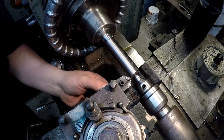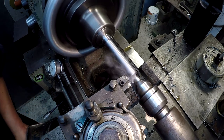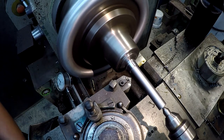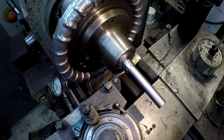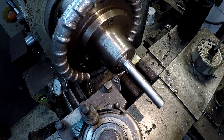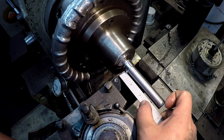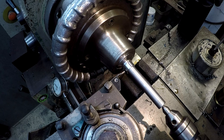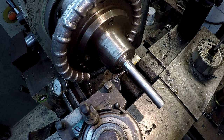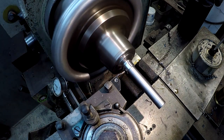We're going to hit some chamfers. That's my MCHNN tool. Use a CNMG insert. All right, so our head thickness is about 3.5 millimeter. So let's make it about 1/8 of an inch here. Okay, there we go. Good enough. Maybe I'll leave that off right there. Okay. See how this does.